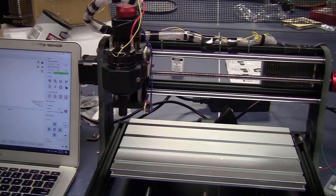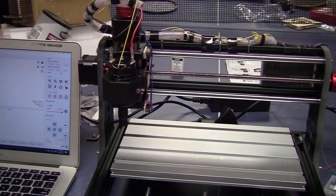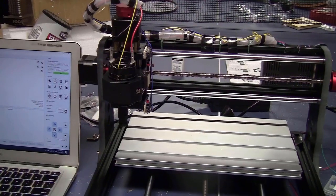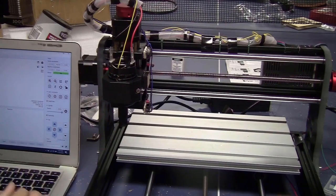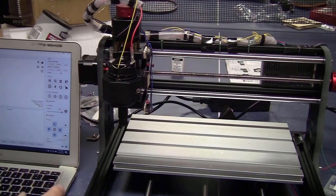It's clicked, it stopped again, cannot move up, cannot move down. So reset, unlocked, move down, it stopped, reset, unlocked, and move down again. It works perfectly. Let's try the Y axis. You also click and stop. I will reset, unlocked, move it back, same thing. And that's it. I think that the limit switches are working fine.